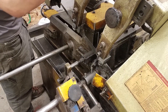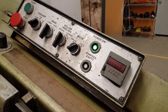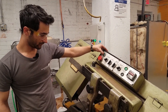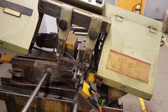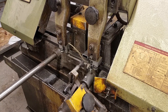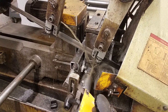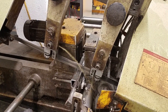The next step is to put it into auto mode. This is a counter which may at some point work, so you could tell it how many parts you wanted — right now it isn't working so it'll just keep going. We'll click start. It's going to cut all the way through, then it's going to hit the bottom, click up, and it's starting on the next one. That's a pretty great feature if you're trying to do a whole bunch instead of getting everything lined up perfectly each time.